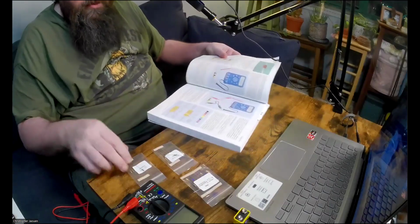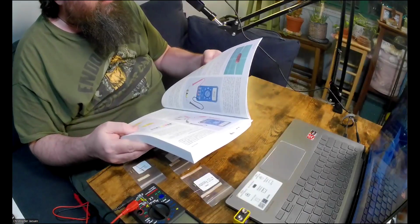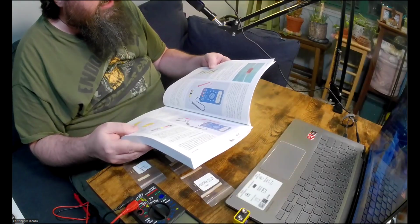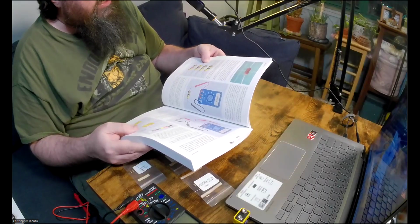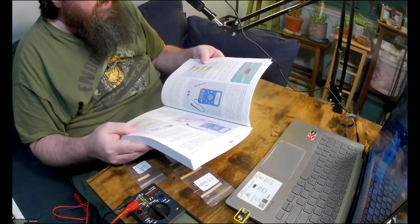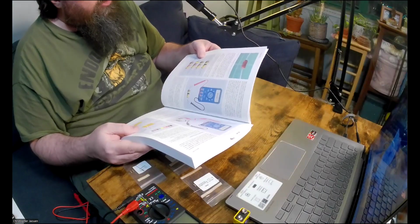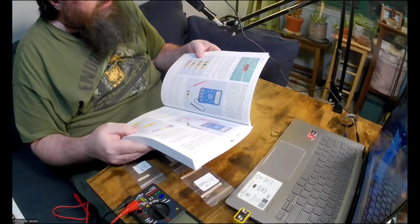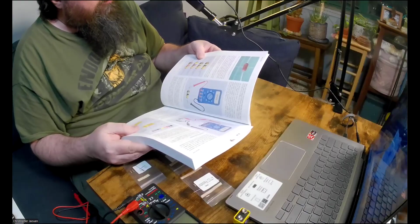All right, so the parts list that I provided for this experiment mentions the colors of bands printed on each resistor. You can see them in figure 2.2. The wires coming out of them are leads, even though they look unlike the leads for your meter or the test leads with alligator clips on each end. The wires coming out of your LED are leads too. Your resistors may have silver bands instead of the gold bands that I have shown, but that's okay. I'll explain the difference in a moment. First, I want you to check the values of the resistors. Make sure the red meter lead